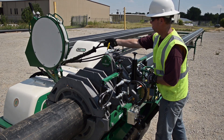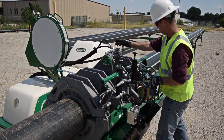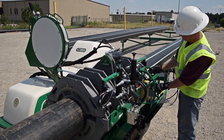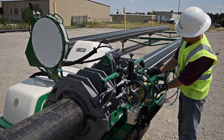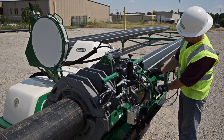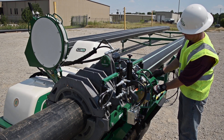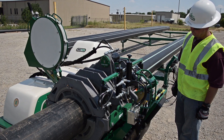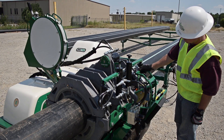Shift the carriage control valve to close and then slowly move the pipe ends against the facer. Control the pressure with the top pressure reducing valve. Use only enough pressure to allow the blades to shave ribbons of material from the pipe ends. If the facer begins to struggle, lower the pressure immediately. Face all the way to the mechanical stops. This will square up the facer, ensuring the best possible face-off.